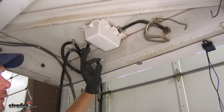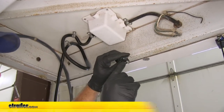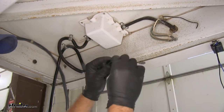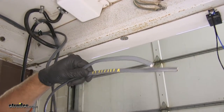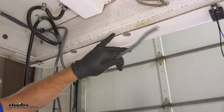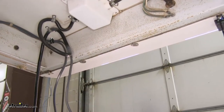We're going to use loom clamps to secure our wiring in certain spots — we have two sizes: quarter inch, part number A0250, and half inch, part number A0500. Since the two wire runs look similar, one was marked before pulling through. We'll use the unmarked wire as the black and white wire from the Hydrastar, and the marked wire as the yellow and blue wire. These four wires act as extensions from the Hydrastar up to where we can make our other connections.